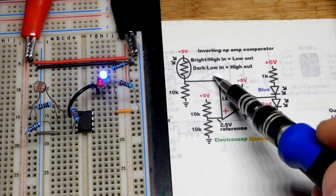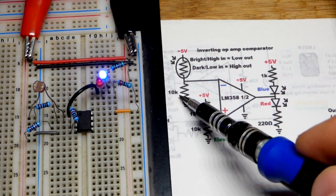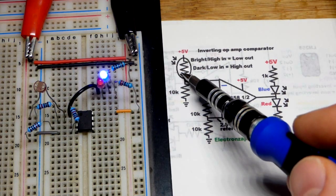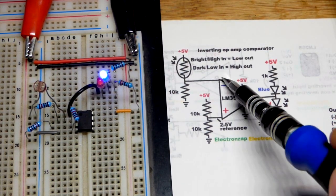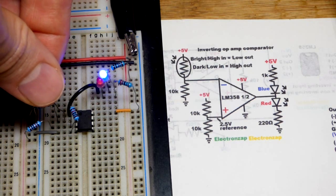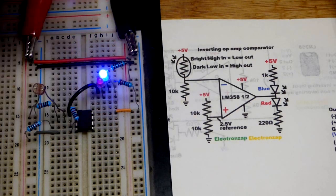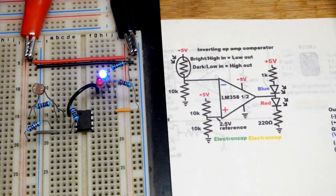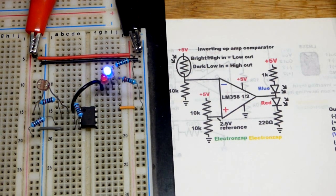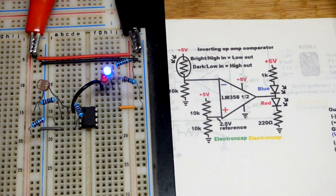When the LDR is at 10k to get half the supply voltage, I could use a 3,000 ohm resistor there — that's a common one I use in my schematics. When the LDR gets down to 3,000 ohms, you'd have half the supply voltage. You can adjust the light level threshold — you could make it so covering it with a finger or setting the lamp to the dimmest would cause the output to go high. You can adjust with that resistor. There are all kinds of ways to build and adjust this circuit.